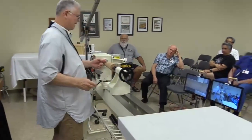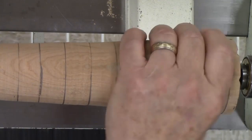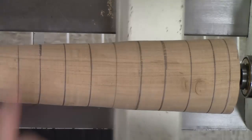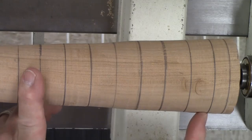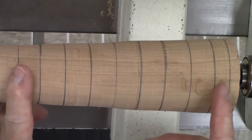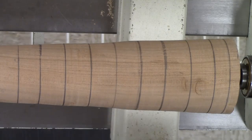I'm using a step center inside where the candle goes and a live center here in the tailstock end. I've got pencil marks on here and I'm going to use a heavier pen so the shadow will be more visible. One thing to mention when you're marking this: be sure and leave yourself enough room, because when you trim this out, it gets weak in here if you don't leave a lot of material. Because when you have force here and you're putting pressure on it, if you don't have anything supported here you can break it out. If you get this too thin, you can break it here.